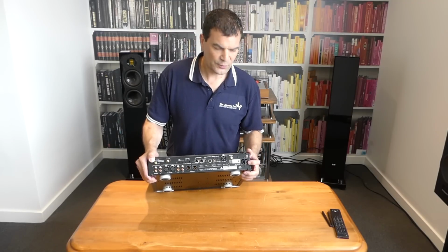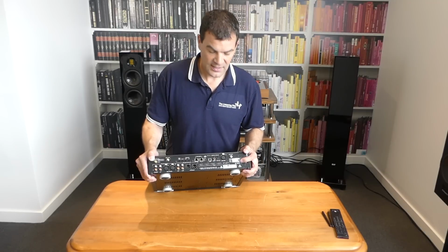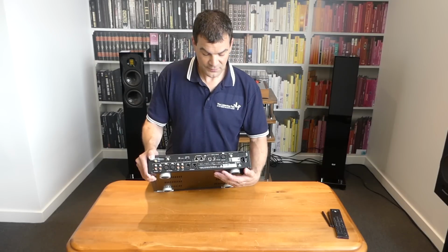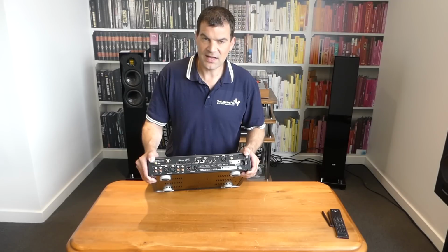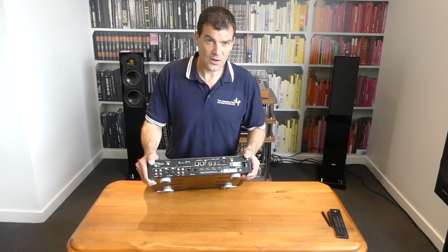Firstly, and at the boring end I guess, you've got the on and off switch and the IEC power input. You've got a label here associated with the voltage and serial number, and it emulates the printed information that was on both of the cartons. So we follow along, you see something that's relatively unique, certainly in its price, is the ability for you to add 4 HDMI inputs in and out to run this through for digital preamplification for the use of SACD and other HDMI based sources. It allows those people who perhaps have a high-end Blu-ray player or a media player of some kind to extract the audio directly from it and then allow the picture only to be sent to a television or a projector. This means it can be utilised in any number of situations where a stereo system is only what you require.